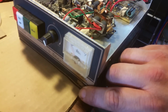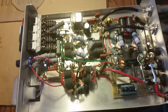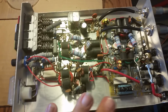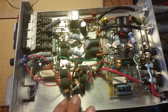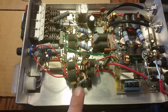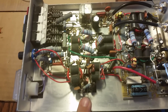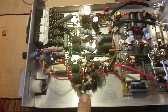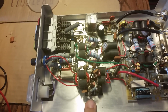Like I said, I'll go ahead and glue that down right there. And like I said, I've done a lot of work to it. And I'm sure somebody's going to ask me, what would you personally do to this amplifier yourself? If this was my amp personally, I would convert it to a 500 and just do away with this driver circuit. I hate dealing with these driver circuits in these 667s, and I can pretty much tell you that's probably 8 out of 10 the reason why the amplifier isn't performing to its full potential of at least 667 watts is this driver circuit.